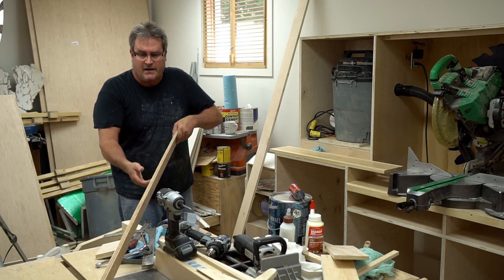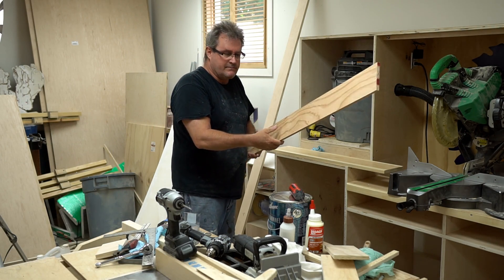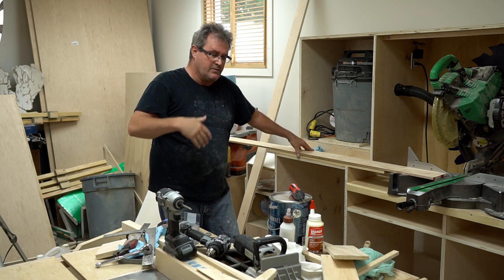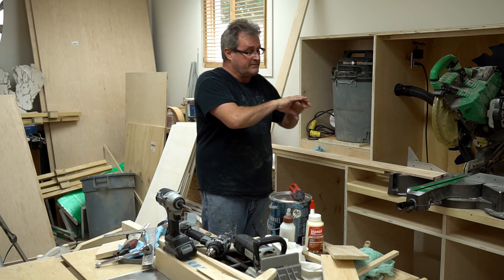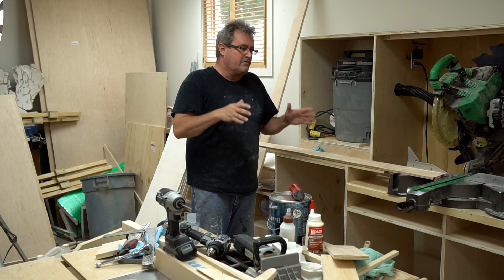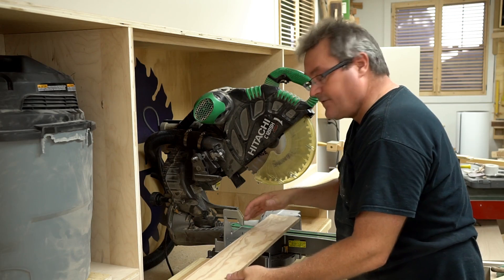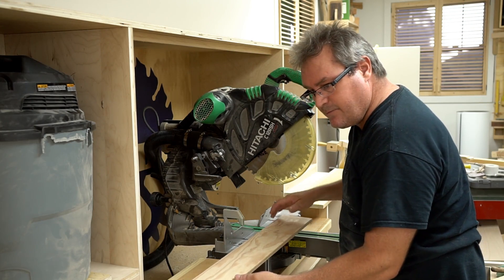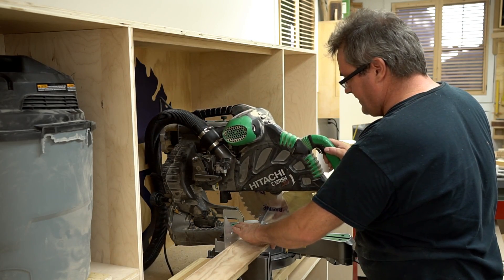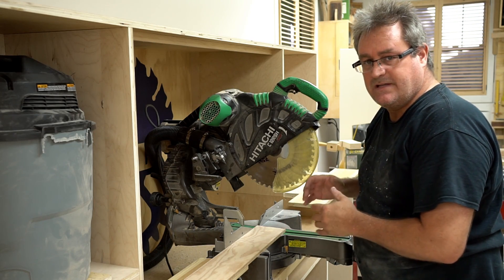For this next part I've cut a strip of plywood a little bit wider than four inches. The wider the better, but you really want to make it no wider than the saw can cut through without sliding it back and forth. This is a sliding saw so it can cut a wider piece, but you want to concentrate on what it does just by swinging down without the slide right now. I want to make sure the edge of my plywood is clean, put it tight against the fence, and slide it up to where I can make a cut to check how square it is.